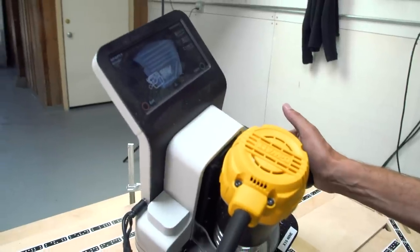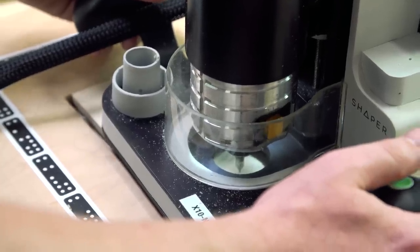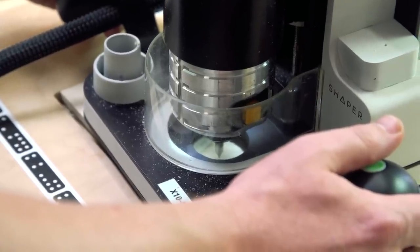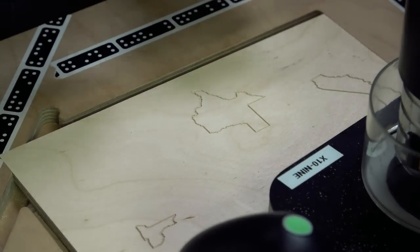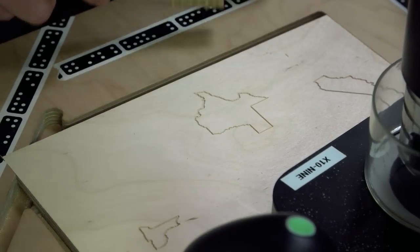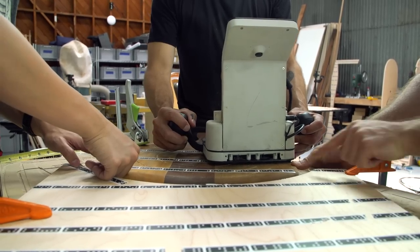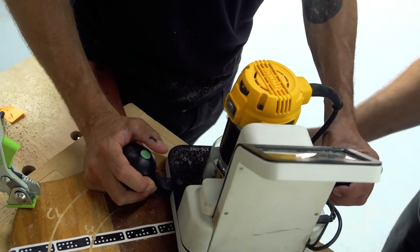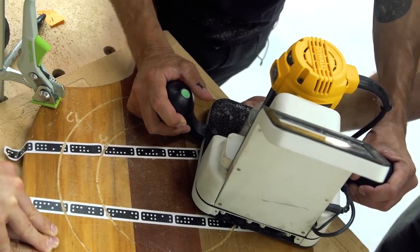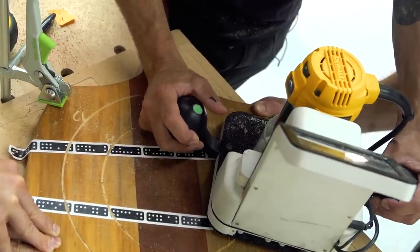So how fast can you cut with this? That also depends on how deep you're cutting and the material. This is something that's not unique to Shaper or to Origin — we're not reinventing the laws of cutting physics here. You can think of it the same way you think of any other router and chip loading. Those types of feeds and speeds apply. You get a good amount of haptic feedback — you can kind of understand if you're moving too fast. It'll give you that feeling, or you'll be exceeding the range of its circle if it's kind of bogged down and it will retract out. But you can actually move surprisingly fast, depending on how you're loading it up and what your depth and cutter load is.